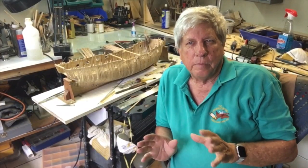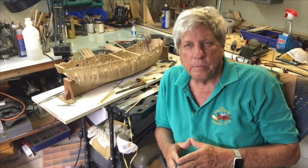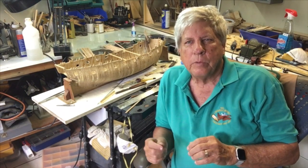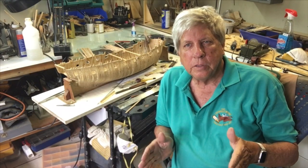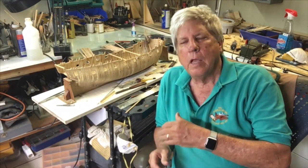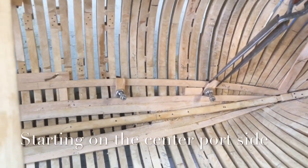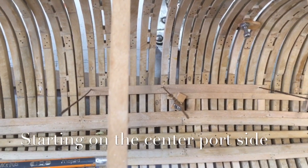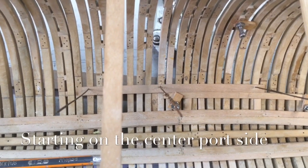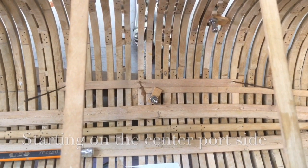Lots of back and forward is the best way to line this up. After much trial and error, I decided to establish an inner button which I would push strake 6 onto, then start with the middle section and move to the bow, and when that was completed, move to the stern. Here is the button attached to the stem at the bow and clamped, and then we have the first 24-foot strake 6 put in place and pinned.